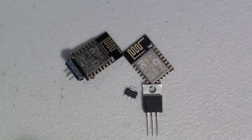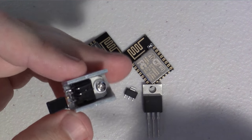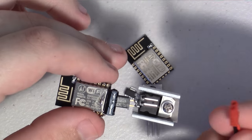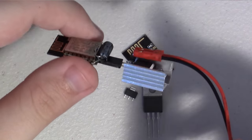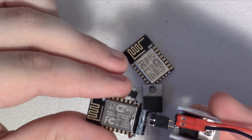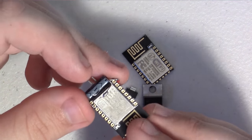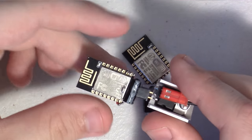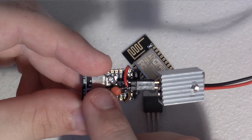So I pulled out the tried-and-true 7805 5 volt regulator and put a couple of output pins on it so I can just plug it right in, and a couple of pins here for a battery connector or wall plug connector. It's not quite as elegant as just having the raw board, but it works pretty well. It means I can take all of my boards and when I need a higher voltage, I just pop on a little 7805 to drop it from whatever the input is down to 5 volts, and then the AMS1117 can do the rest of the work from 5 down to 3.3.